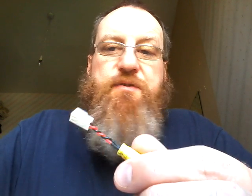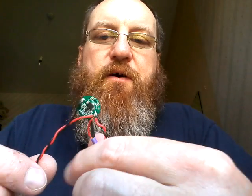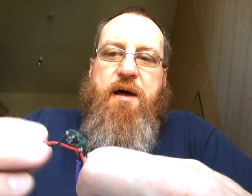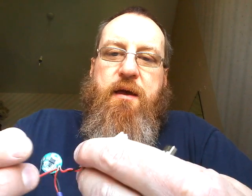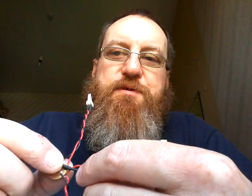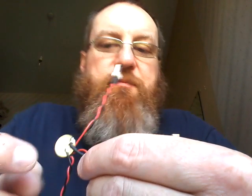However, it seems to take solder fine. I soldered on a connector, and then got the circuit module out of the end of a standard lithium-protected cell that I'd cut down in size to fit into a USB battery bank. I put a connection on for charging the lithium cell, a connection for the output, a USB lead, and a 22 ohm resistor to limit the current going in.